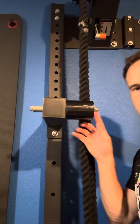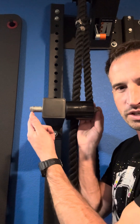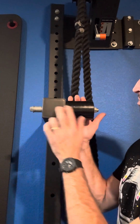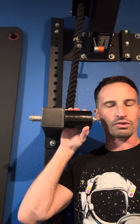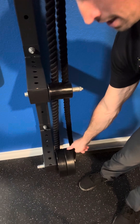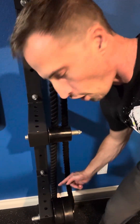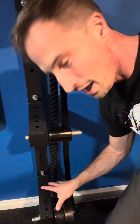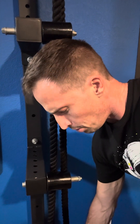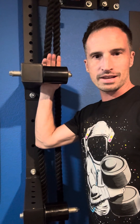What really makes this function properly is these. They were dirt bike axles — I found the ones that work best and ended up having to sleeve it a little bit so it was the right length. And these are the wheels from a pallet jack. These are two of the smaller wheels, and down at the bottom there are the big wheels from the turning part of the pallet jack. Because the bottom angle is a longer turn for that rope to begin going in a different direction, I opted to put the widest pulley on the bottom for the most relief, with the other two pulleys above, tightened just enough that they spin freely.